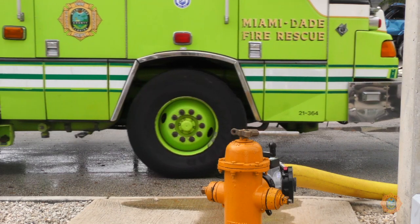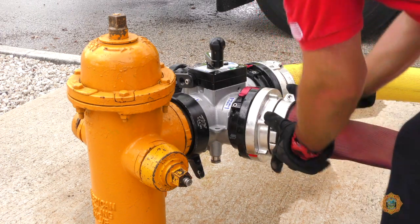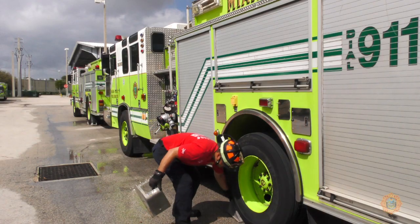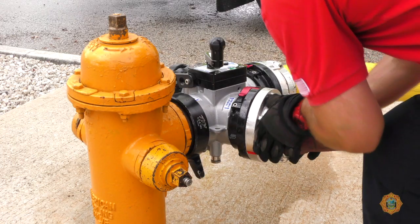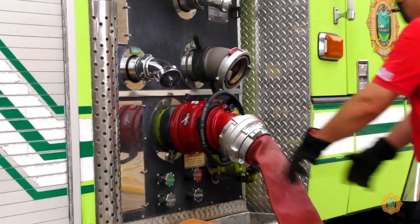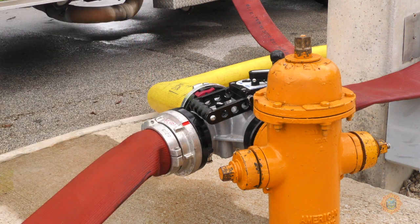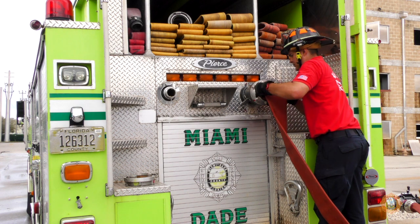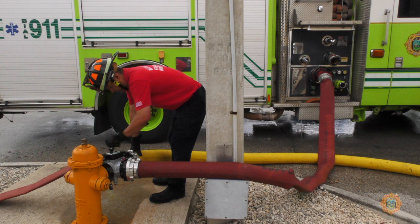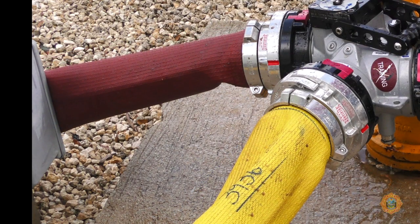The apparatus should be positioned close to the hydrant so as to allow hose connections to the hydrant assist, utilizing shorter sections of 5-inch hose. The pump should be engaged and drive wheels chocked. A section of 5-inch hose should be connected from the un-clappered side discharge on the hydrant assist to the main pump intake. Another 5-inch hose is then connected from the clappered side discharge of the hydrant assist to a large-diameter pump discharge. The hydrant assist handle is turned to the boost position to allow water into the hose. Turning the handle in the other direction will result in complete shutoff of the hydrant.